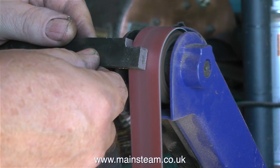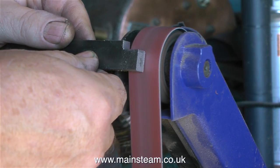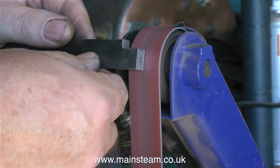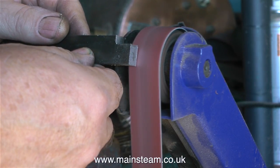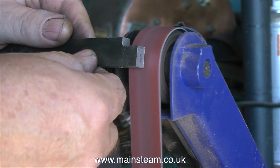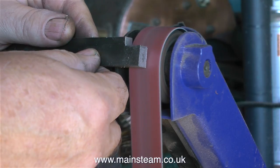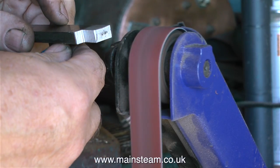Using the top of the belt sander I'm shaping the underside of the die block first - this is the concave part. The way I'm making this die block owes more to common sense than it does to model engineering. I initially cut the piece of steel so I had a piece on the end of it that is half an inch wide, and I haven't separated this piece from the main bar stock because it's very useful to be able to hold the bar stock without burning your fingers.